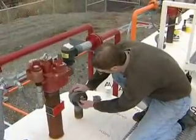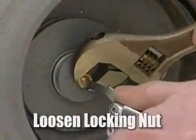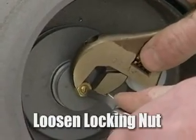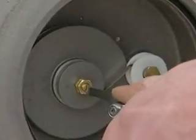As you can see in here, this is our adjusting screw right here, and these are our two lock nuts. These nuts will have to be loosened up. We'll just put a wrench on that. While holding this, we will turn the lock nuts back, and what this does is it loosens up the adjusting screw.